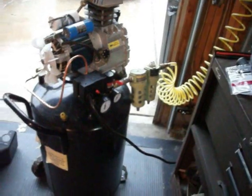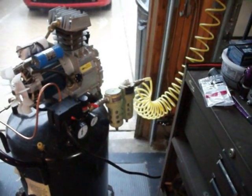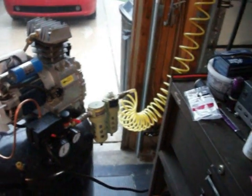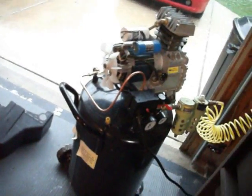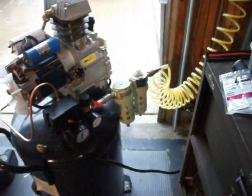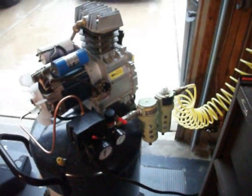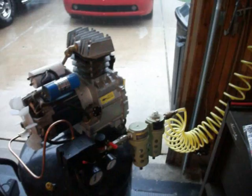When you break it in, you can break it in on a lower pressure, like 60, then increase it gradually, and then back off, and then go back up on high speed. So you're going to get a little bit of the low, and then a little bit of the high, but you don't do it constant. Just constant time maybe, but a lower pressure, higher pressure combination to take it easy on that piston initially, and on the rings too. And then after the hour, you drain it, like I said, and then you replenish the oil to 30 ounces, I believe it is.